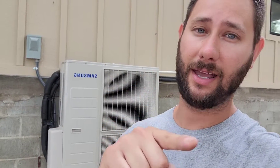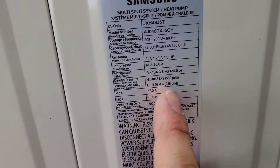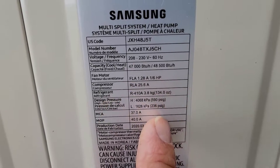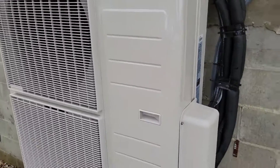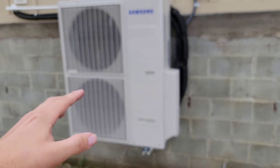I'm going to give you tips to charge multi-zone equipment, but first the manufacturer's recommended method, which I use 90% of the time. I use it because you won't make as many mistakes that way. The manufacturer recommends you factory charge — so you look at how much refrigerant it holds: 134 ounces. Divide by 16 to get pounds if needed. Always factory charge the equipment.